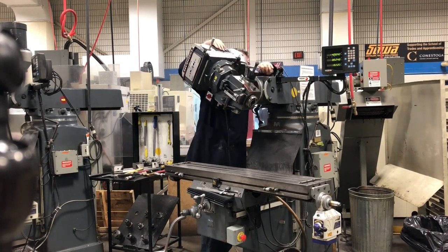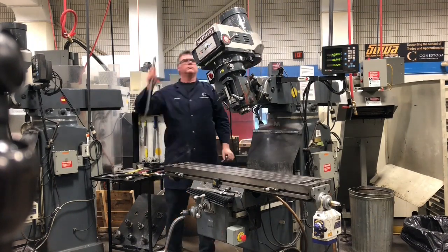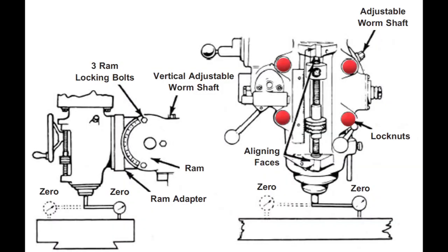Here we go — over. The replacement of the head tilting gear is 100% avoidable if we loosen the lock nuts that hold the head before putting a wrench on the worm adjusting gear. Never loosen them completely — always leave them slightly snugged, but not tight.